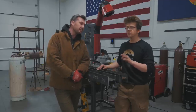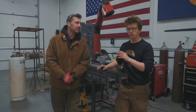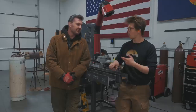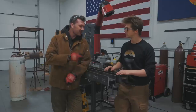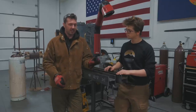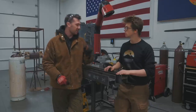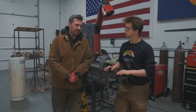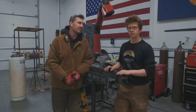And what's crazy is he was showing us a little bit earlier, we'll do a little demo now, but you had the welder cranked up on every single dial. Wire feed max, power max, and you just lay it down. It doesn't even burn through the stuff. No. You just lay it down. Yeah, so with this gas, it's pretty versatile. You can weld up to a half inch thick or all the way down to like 3/16. Right now I have the wire speed cranked way up just to weld quickly, but you can play with it as it's really flexible. So, it's amazing. Yeah. So it's cool.